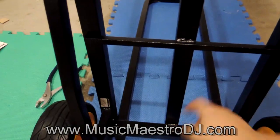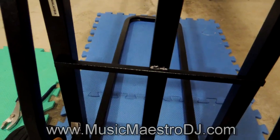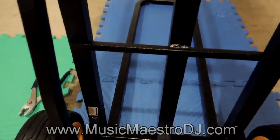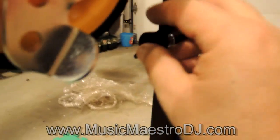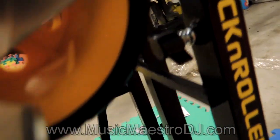To release the pin I'd have to press it in and pull it up. If I end up using it at full position all the time I guess it's all right, but you'd either need to release a pin down there - which they should do by drilling one more hole during manufacturing - or you'd have to loosen the knobs every time. If you don't tighten it, when you flip it up to pack it in your van, the thing is going to slide out on you and that could be unsafe. So make sure it's tightened up.